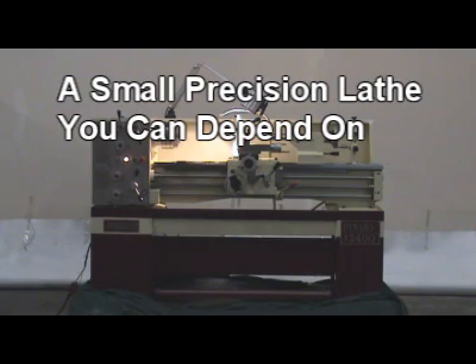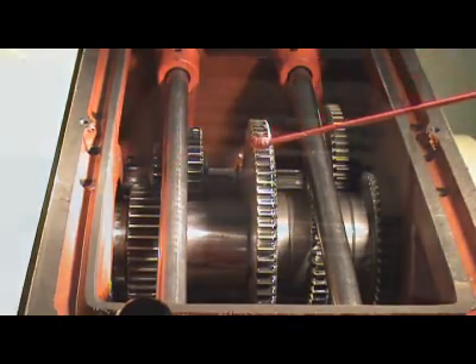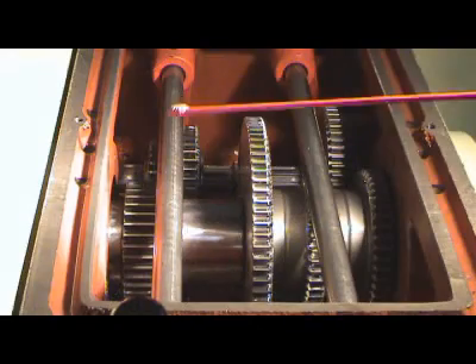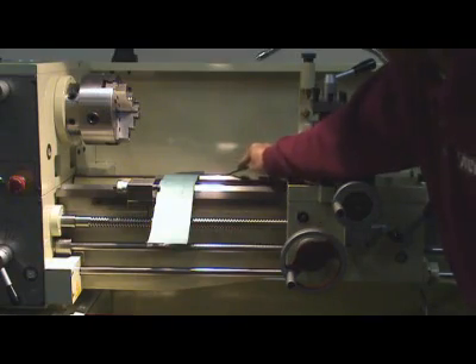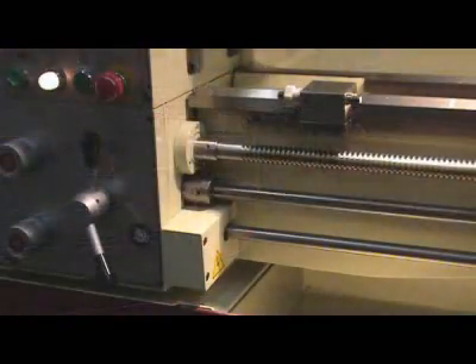Acer builds small precision engine lathes to provide the best solution for your tool room precision turning application. We start with the most basic foundation: a heavy duty enlarged Meehanite casting bed with a heavy sheet metal stand to resist flex and dampen vibration. Every one is thoroughly inspected prior to machining to ensure it is free of flaws. The machine is equipped with a three horsepower continuous motor to provide high torque, with two taper roller bearings for heavy duty turning. All bed ways are hardened and precision ground to ensure accuracy and long life.